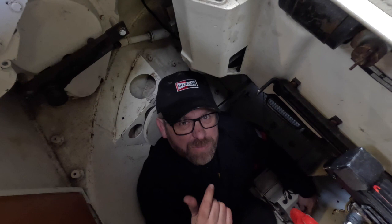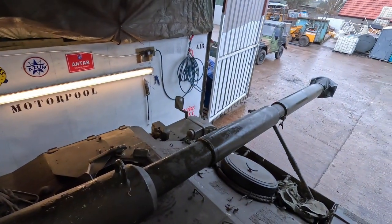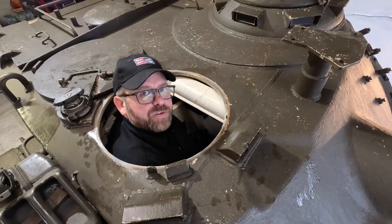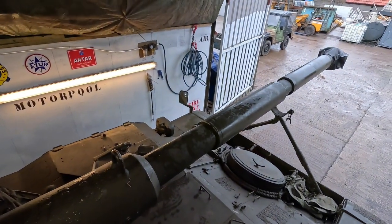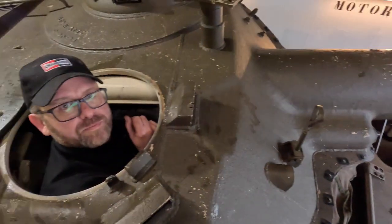Now I'm down inside the depths of the tank turret. I'm going to turn on the hydraulic motors — you can hear them now in the background. This enables me to move the gun using the joystick. We're going to lift the gun up, and now we're going to turn the gun over to the left. The final operation is to turn the hydraulic motors off — there's no point in them running. This will settle into a relaxed position. I've now moved the gun out of the way and we have access down to the fan.